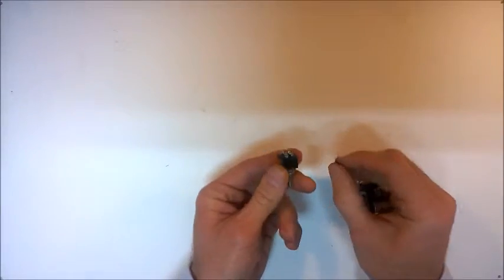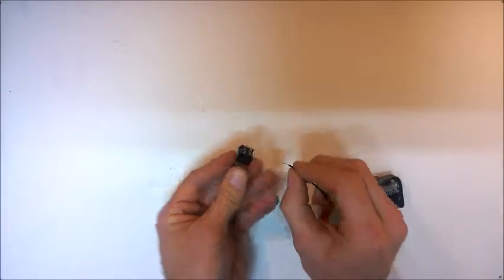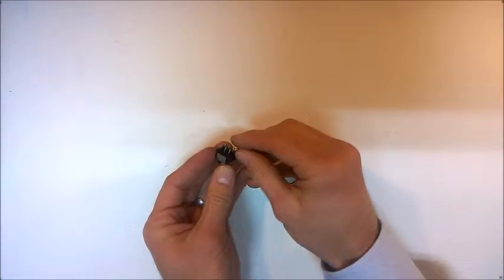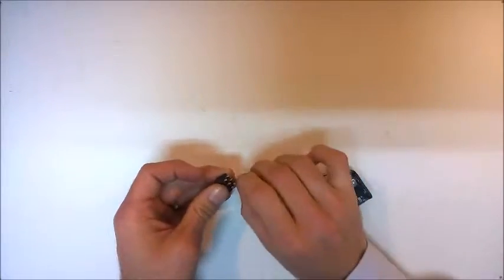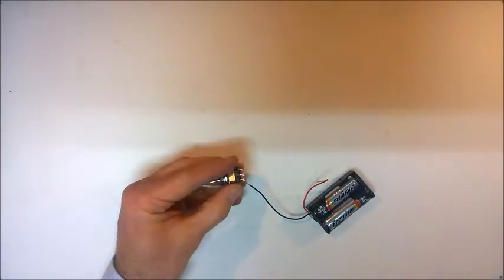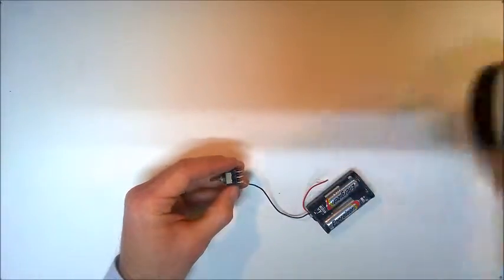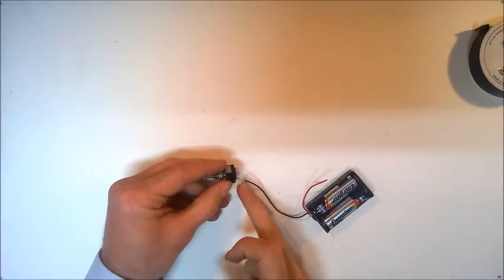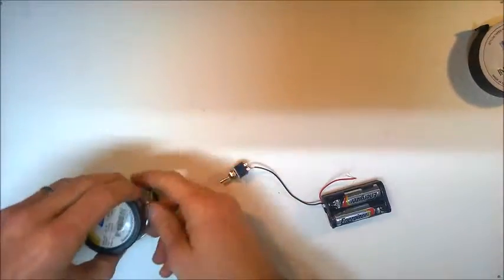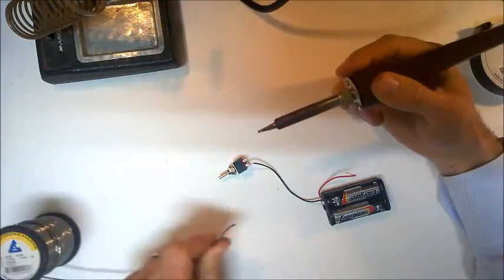So we just need to take the wire that we're using and then thread the wire through the hole, and then fold it back over itself and twist the wire back on top of itself, so we get again a good connection. Might just pinch that wire onto the terminal so we get a good connection there. Now it would be hard to put insulating tape around this at this point because the terminal is very small. So what we might do again is just use a little bit of solder just to ensure that our connection doesn't come loose once we put it inside our building.